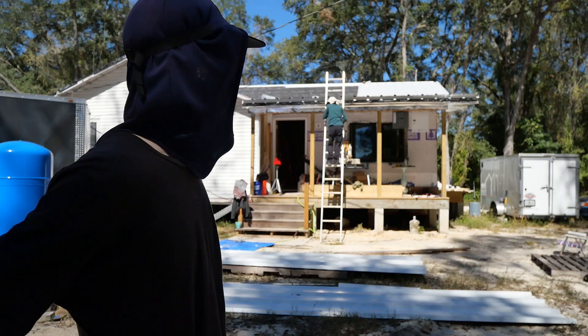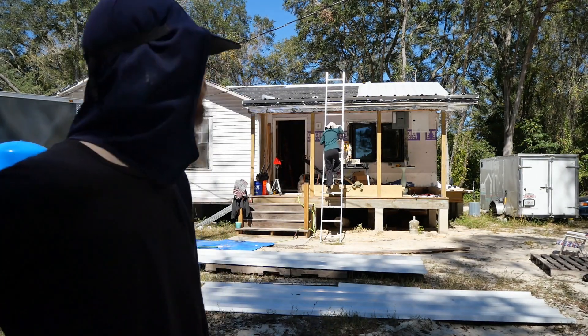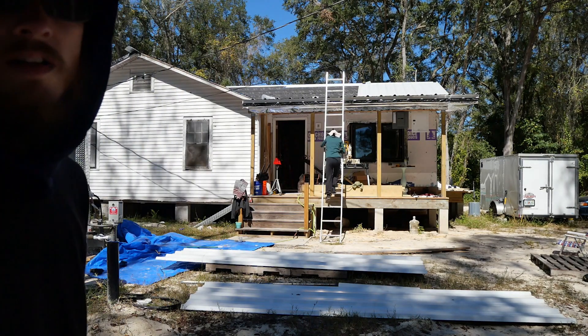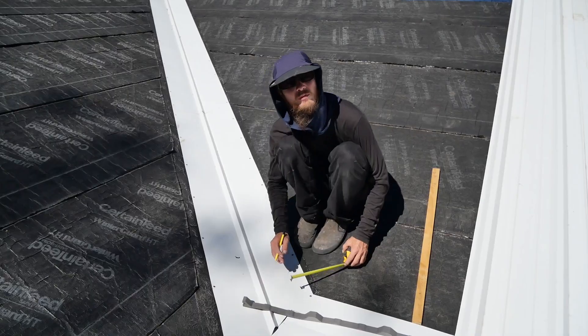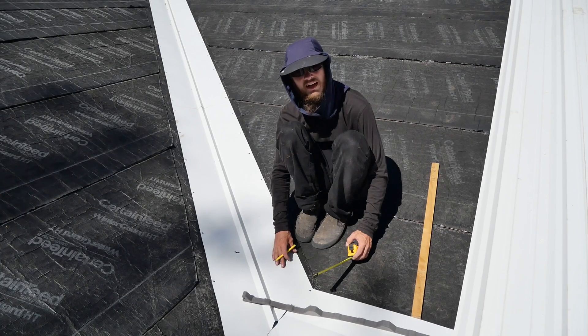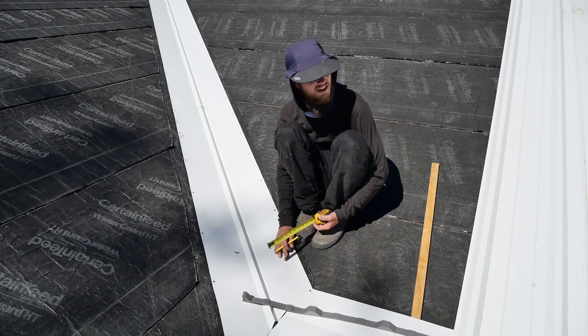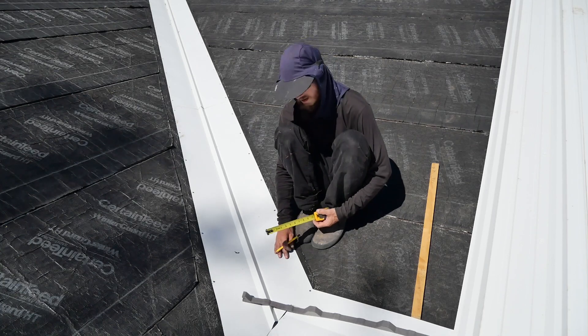How many are going up there right now? One, two, three. I think just two more full ones and then we'll figure out what's next. I think we'll have to start cutting the valleys after that. We've made it to the valley. So right now I'm going to mark out where the metal needs to end — three inches from that valley center — and we're going to draw a line. And then this is going to be the first valley cut.